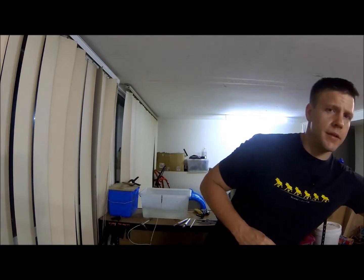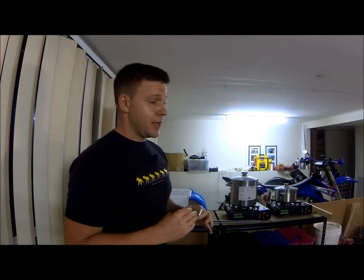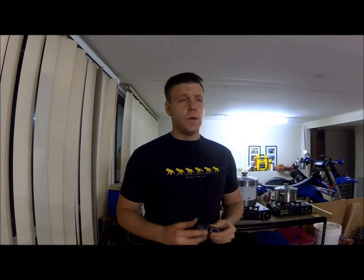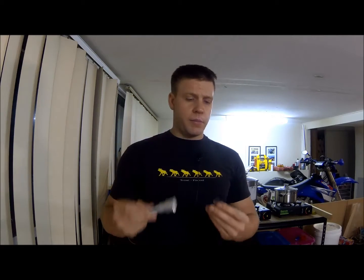Anything to do with aluminium - always have nitrile gloves handy. If you're going to anodize you need your safety glasses because you're playing with acid, and wear your damn gloves. Now, I wouldn't endeavor to anodize unless you were going to be using it a lot. It's not expensive to set up but it takes up space in your shop - you can't just pack it all up and put it away. If you're going to be making parts a lot, set it up and have it always there.